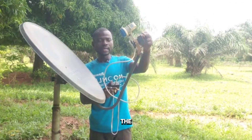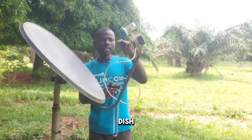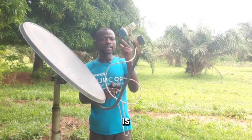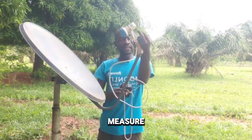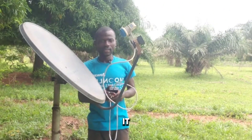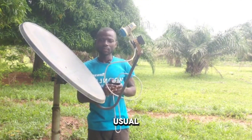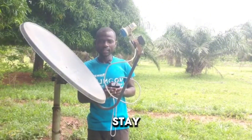After getting the 16 degrees signal, you add your other LNB to the dish and then track. The distance depends — for me it's almost the length of my middle finger. If you have a long finger, the distance is similar: just about the length of your middle finger. This is how you combine your 16 degrees, 28 degrees, and 26 degrees on the same dish. I hope this video has helped you — share it so others can also enjoy it. Thank you, stay tuned, goodbye.